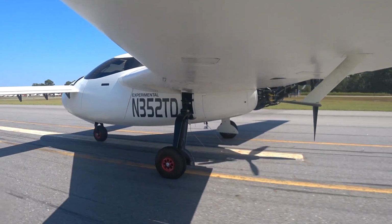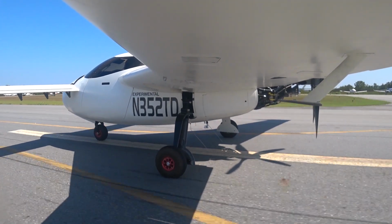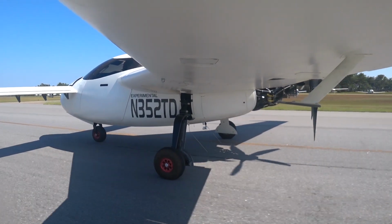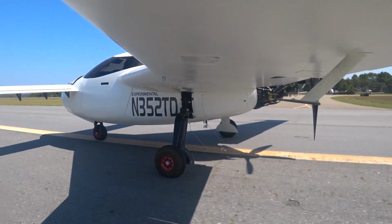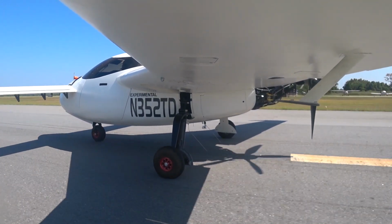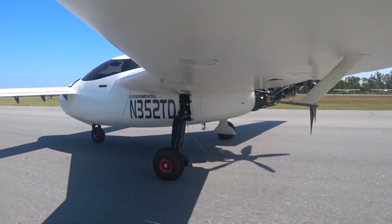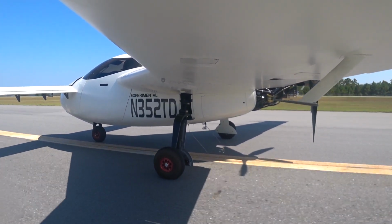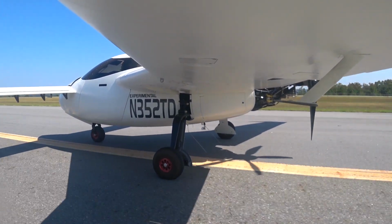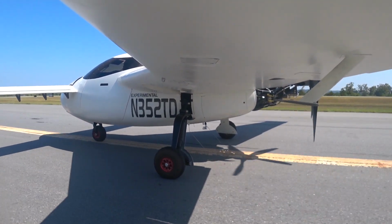So this one was actually the last run that I did, and I ended up getting exactly 53 miles an hour again, the same as the previous one. So out of the last 3 runs, the first one was 57, and then the next 2 were 53 miles per hour. And this one still went sort of not quite full throttle, but I did get the maximum RPM, 3,800 RPM, just not as much fuel being delivered there, so just not quite as much boost. And I haven't really had a chance to look in too much detail at the performance logs from the ECU, and I'll have time to do that over the weekend.